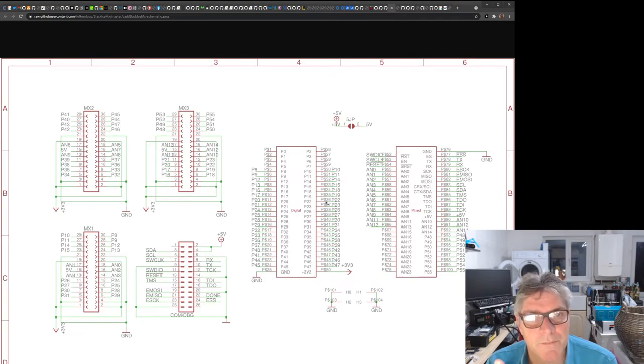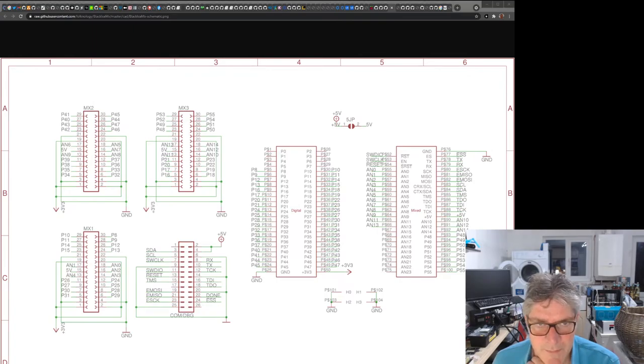There's the triple axis Trinamic stepper controller tile, which is a high performance 256 microstep per channel, and that has three step channels like an XYZ plus potentially three end stop inputs on it. It also has SPI. Don't know what else I could put in there on that. Not much room on that. Let me remind myself where I am with that again. I need to finish some of these.